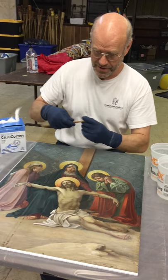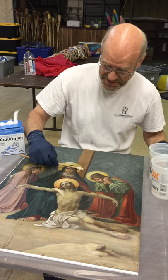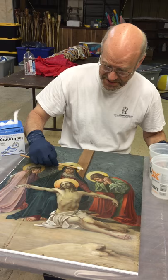After we get that surface dirt off we can move on to the second solvent, which you'll see a different color comes off — it's a little more yellowy-brown. That's the color of the old varnish that's on there, so we clean that off as well. You can see there's quite a bit of it on there and the color keeps changing on the surface.